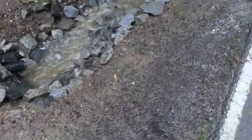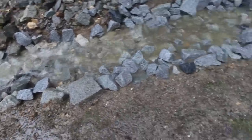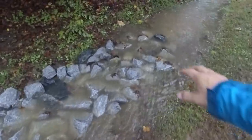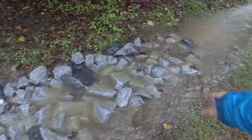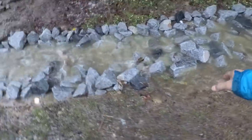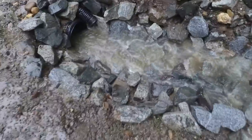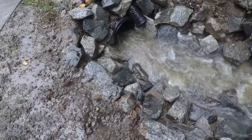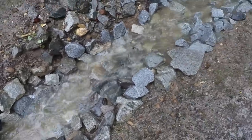It's the next morning here, and I wanted to come out and take a look at what's going on with this drainage pipe that we mucked out yesterday. This is exactly what I was hoping would happen — we're slowing the water down right here. You see how fast it's moving up there. We're slowing it down here, it's not coming out into the street, and it's now getting re-channeled and going right into the pipe. That's exactly how I was envisioning and hoping this would work. The whole idea was the water was coming down way too fast across here and then skipping over the driveway, so it looks like this is going to work pretty well to solve this flooding issue.